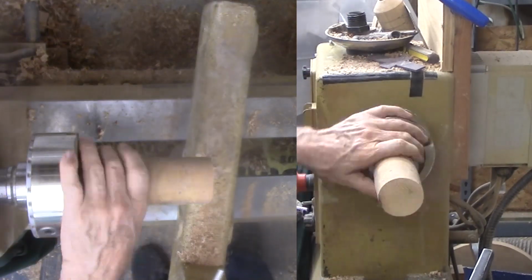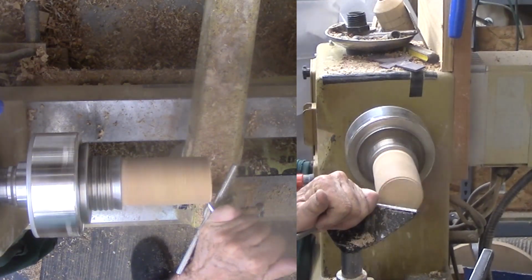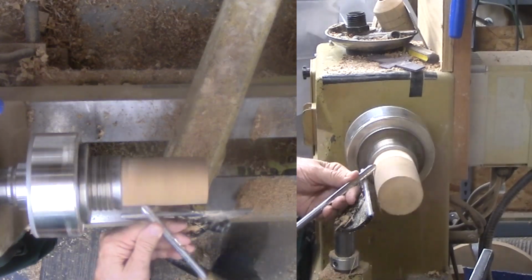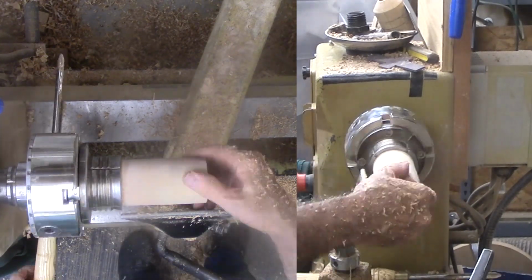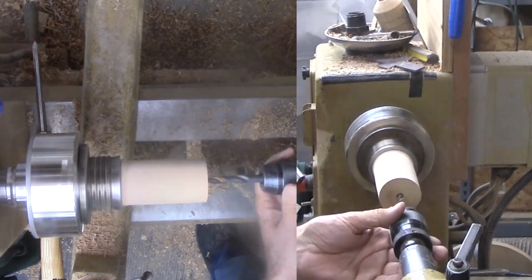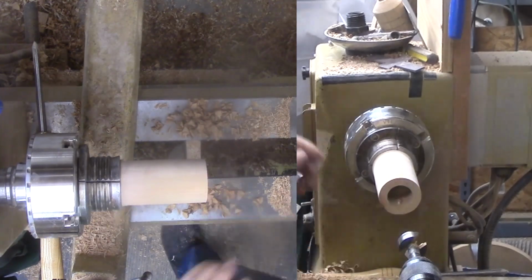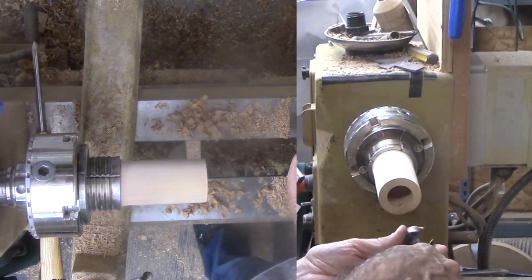With the wood securely mounted, I can trim the end and the sides of the cylinder. I chose to drill out most of the hollow. I will do this in stages. First, a larger twist drill, followed by a medium Forstner bit, and finished with a final Forstner bit. Despite the additional bit changes, it is actually quicker than drilling a large hole all at once.